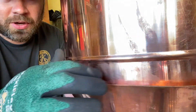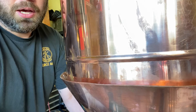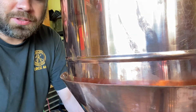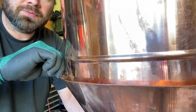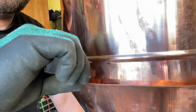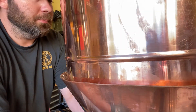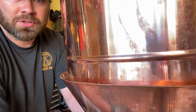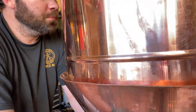Sitting inside of the collar, there's going to be a little lip right here and you're going to be soldering inside of this lip. For prep work, take a little bit of sandpaper and knock the burrs off the edge — there's just a little sharp edge there, you don't want to cut yourself. Also make sure you go seam to seam, so each seam that you have should line up with the next seam behind it.